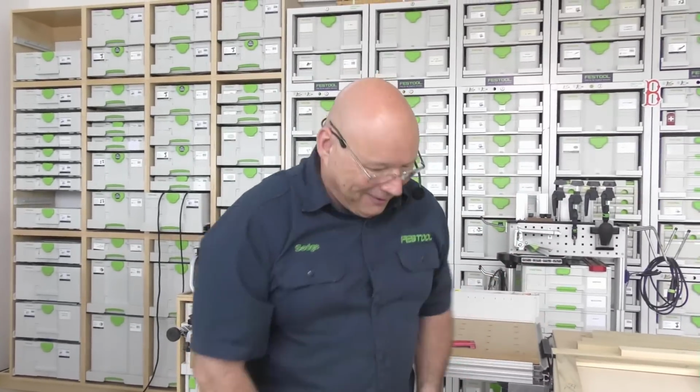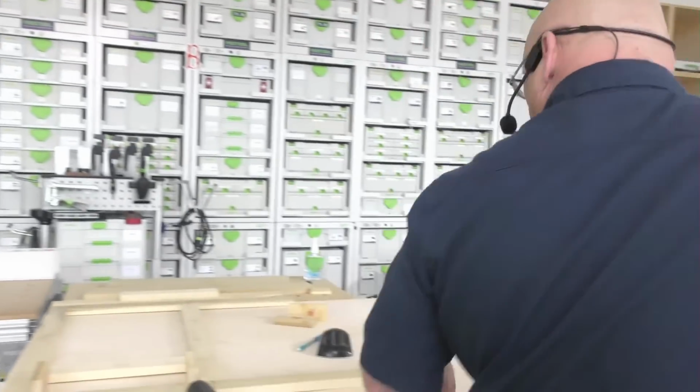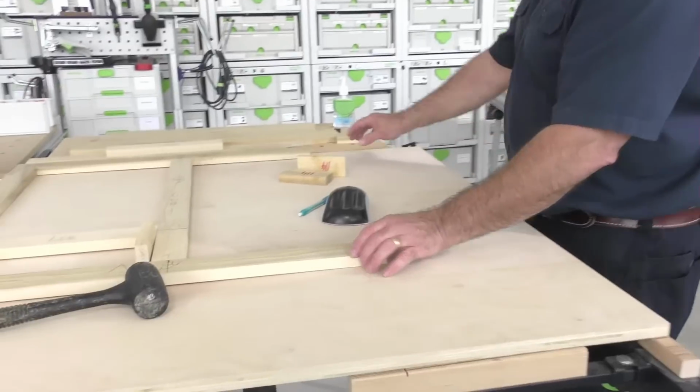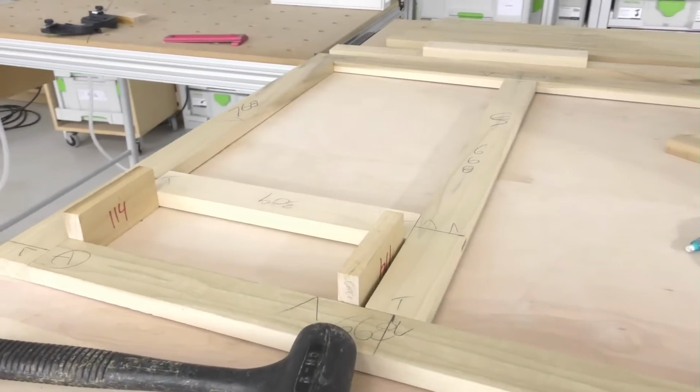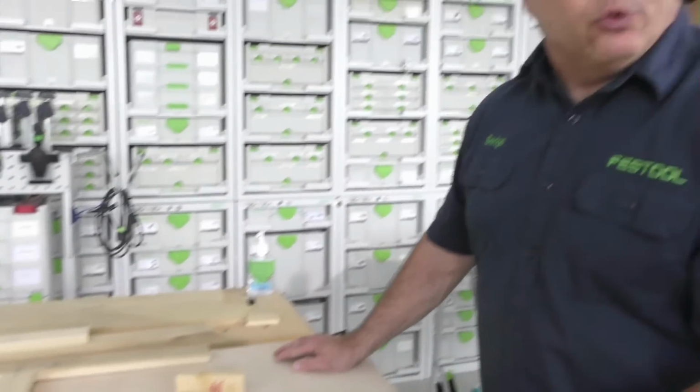And then at the end, after glue up, they take it out and it'll be perfectly square. You start with square parts. It ends up square, okay? But you can always check. So I just want to point that out. That's half the face frame. See how quick that was? I think I did that under 20 minutes after gabbing too much.